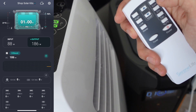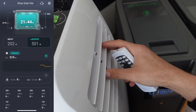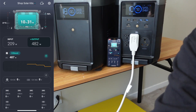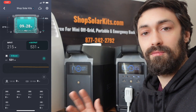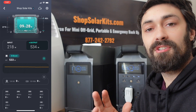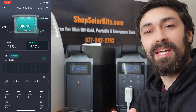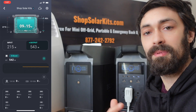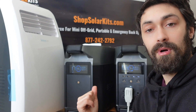It doesn't go less than 60 degrees. You can hear the condenser kick on — this is definitely cool. We can see the front of the unit at around 550 watts or so. That's going to give us around 9 to 9½ hours of runtime with the Delta Pro and the expansion battery. I haven't factored in the inverter efficiencies — I've seen it's roughly 88 to 92% efficiency — which means we're not going to get the full 9½ hours. But 7½ to 8 hours is going to be a super reasonable amount of time that you would be able to get maximum cold on this air conditioner through the Delta Pro and the expansion battery.